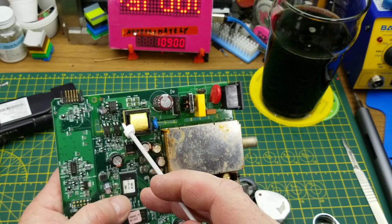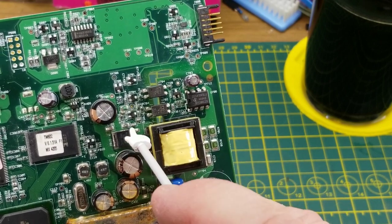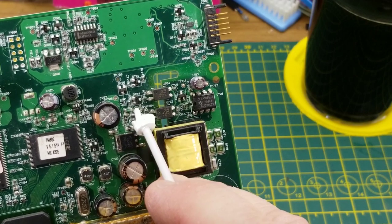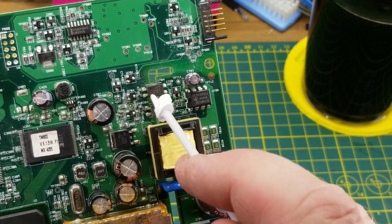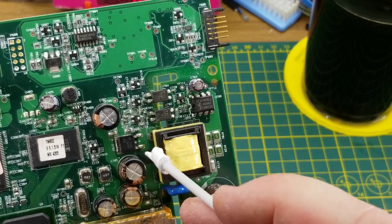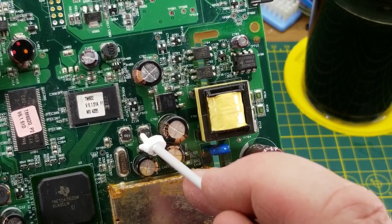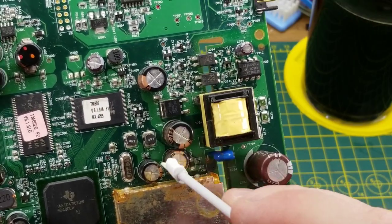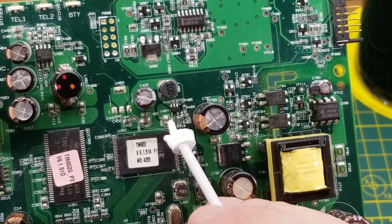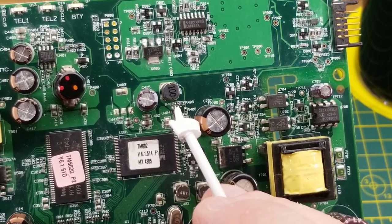After the transformer, as you'd expect, we have a dual diode, some filtering capacitors, a couple of transistors, and a couple of diode packages in SOT-23 format that will be creating the reference for and driving the LED side of those two opto-isolators. There are also a couple of inductors down in there. This chip marked U, with its capacitor and larger inductor, is probably either a boost or a buck converter circuit.